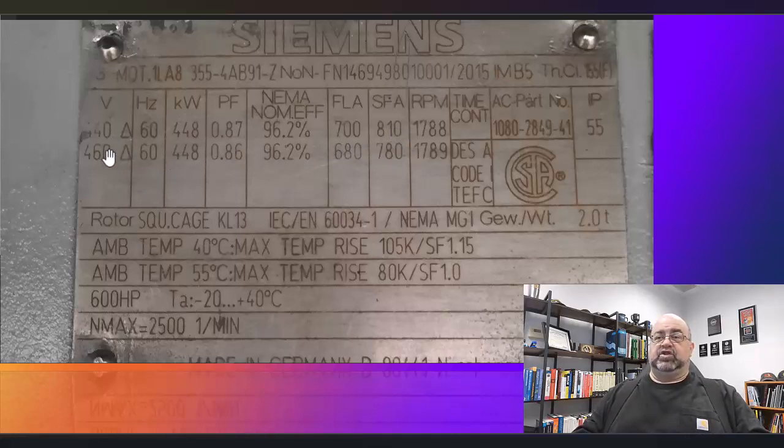For the particular machine we're going to look at, say it goes up to 470 volts. That would mean the current, if we assume it's linear, which it's really not, as you begin to saturate and increase voltage, it's more of a logarithmic curve. But in any case, at 470 volts it would be half of that difference, about 30, so 15. So technically it would be at, say, 765. So again, a lower current than this.